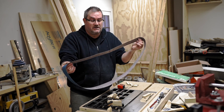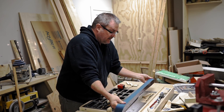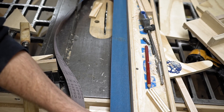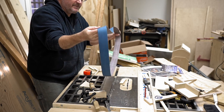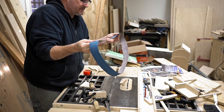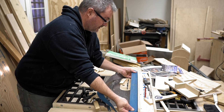As for the belt where it's stretched, it looks like it's stretched right at the splice. When I take it and stretch it tight between my fence — which is straight — I can see that it's actually about an eighth of an inch away from the fence at that splice. And if I flip it around and go the other way, it's exactly the opposite — this end is away from the fence with the first part of it tight against it.